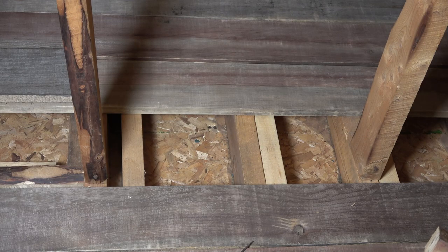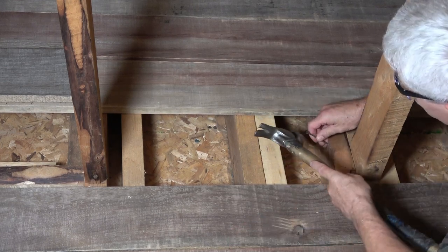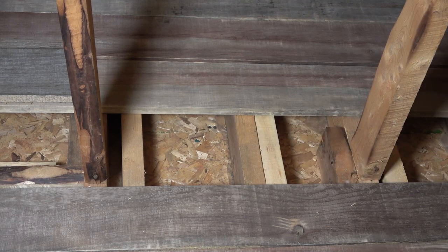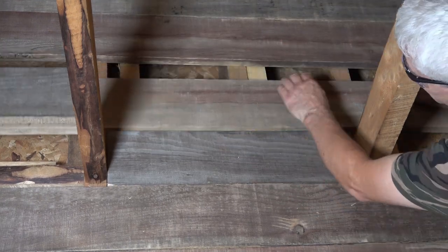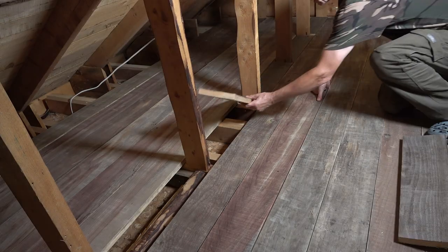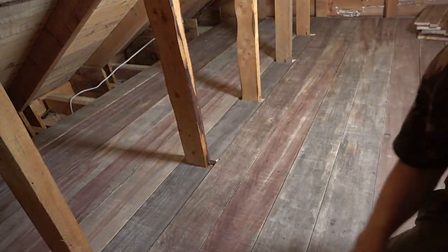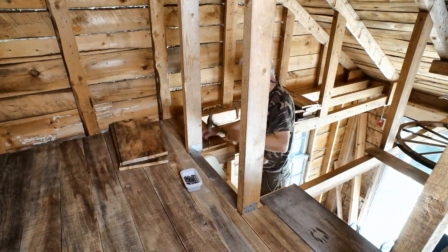In the spaces between the struts, I first had to add a few support pieces made from old scrap wood and nail them in place. Then the new floorboard was placed on top. I'd like to fasten all these boards in place, but there's still wiring to be done underneath. So I have to leave access to the electricians, but there were at least some sections I could nail down. Like this new end platform.